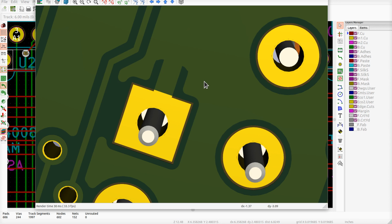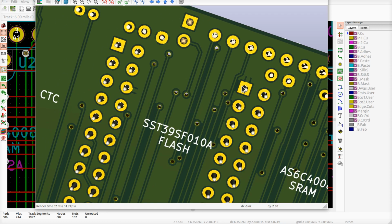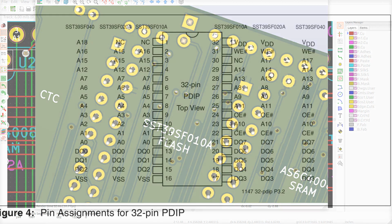All right. Now, fortunately, we don't really have to do this for the specific modifications that I'm going to talk about in this video. However, if you use different kinds of flashes, and one of these pins needs to get pulled up to 5 volts instead of connected to ground, that's one way you can do it.